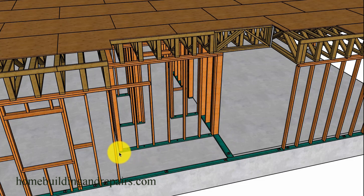For those wondering why this plate doesn't run through — let's throw the base plates in for the stairway. You can see it's set back about an inch and three quarters. These base plates will need to be treated on a concrete foundation. They can be regular two-by-fours, or you might not even need them. I wouldn't use base plates on a stairway with a wood framed floor sheeted with plywood or OSB — just put the stringers on top.